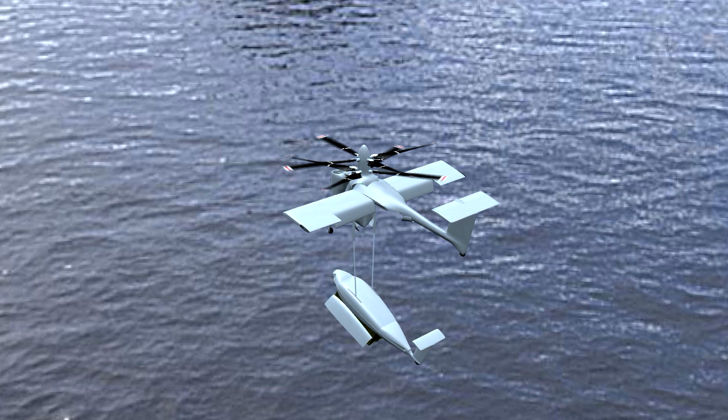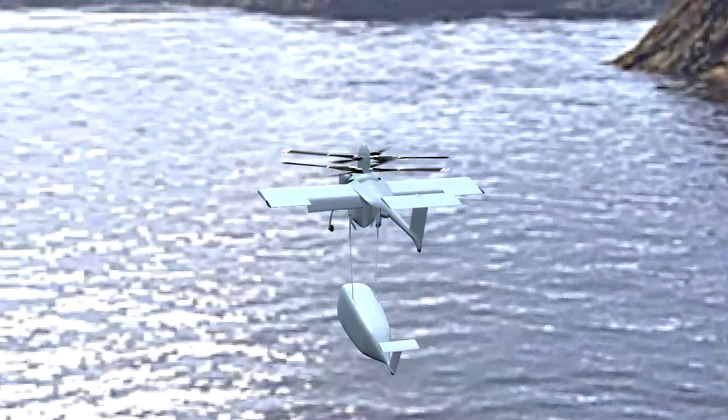Compared to conventional side-by-side tilt rotors, this coaxial configuration avoids the upward fountain of air at the center line, with up to a 20% impact on gross lift capacity. Later in this video, a hover configuration with drooping wing panels is shown, which has potential benefits to be traded against operational impacts. After liftoff, the cargo pod envelops the containers.